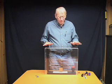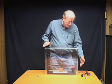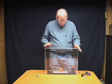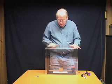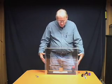There will be too much noise from ambient motion of the air, just causing slight vibrations of that magnet, of the whole boom going up and down. So the cover is absolutely essential to recording earthquakes.